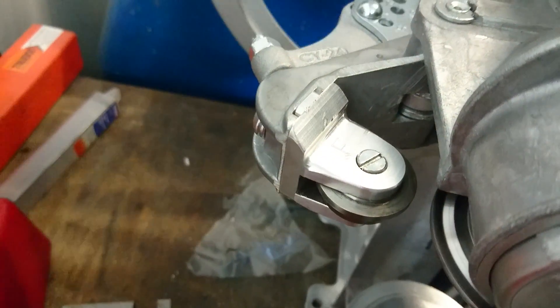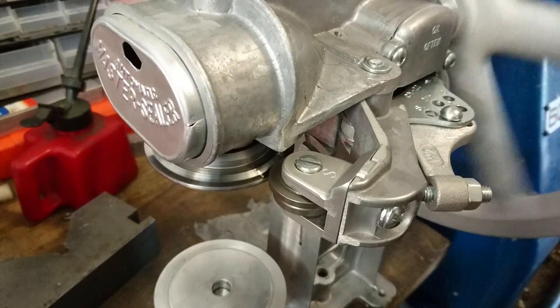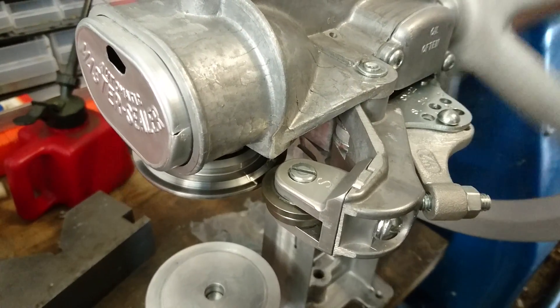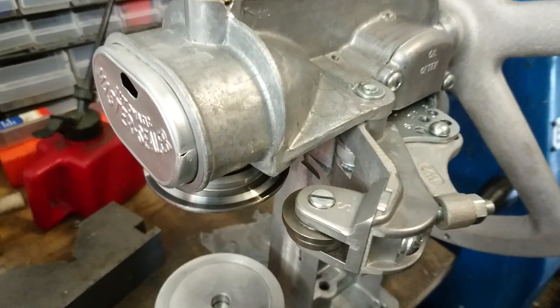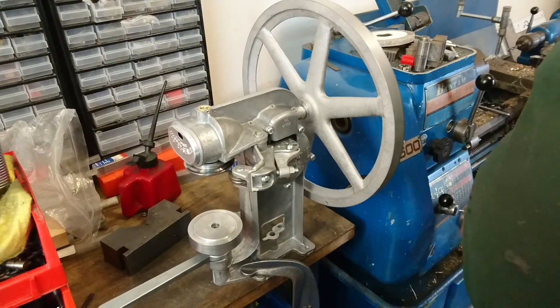A further 10 turns brings your second operation to its furthest point in. And then you keep watching — as soon as the second operation comes out, that is zero position. The machine must be left in zero position.